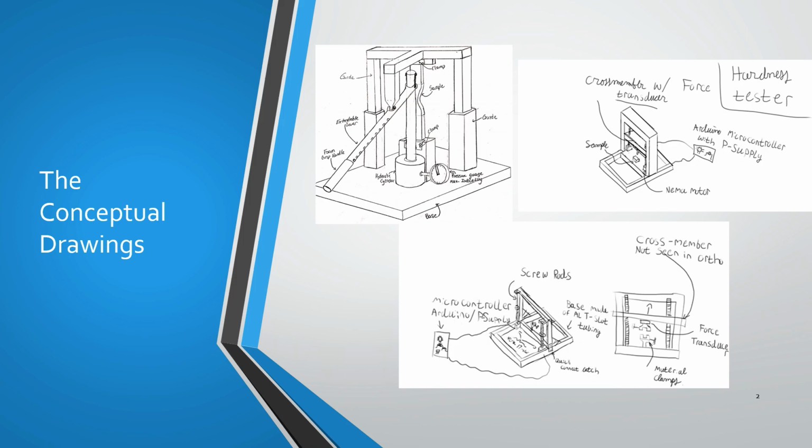So the Arduino Uno, in our case, receives information such as the amount of force, and then using other things like a strain gauge, we're able to get the stress-strain curves because we know the dimensions of the material. Those can be sent to graphs. From these graphs, we're then able to get the true engineering strain and stress values that are most commonly seen in the materials lab courses that we're used to.